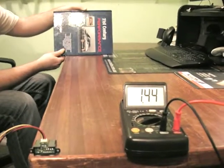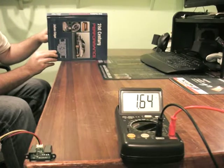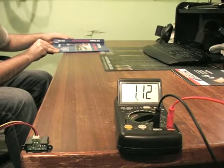Starting it perpendicular and rolling it back — the reason we didn't do these angle tests on the ultrasonic sensor is because we knew it was very dependent on angle. But when we tested the linear photodiode, it seemed to react really well to angled surfaces. You could put a fair amount of angle on it and it would still read quite accurately — there wasn't much discrepancy because it was picking up the position of the light source, where the energy was coming from.